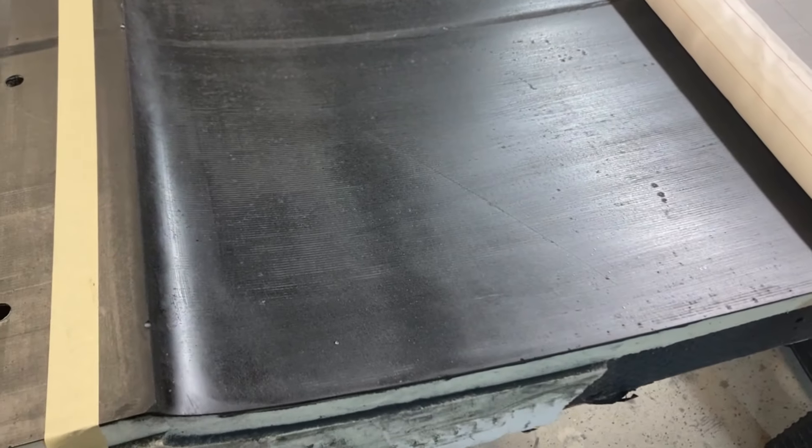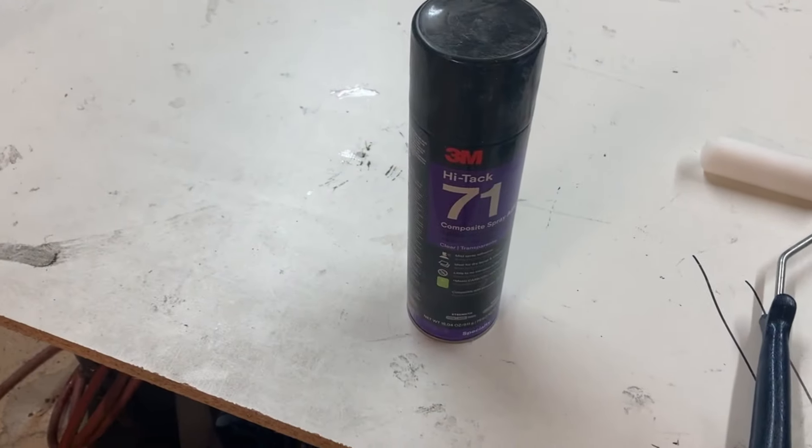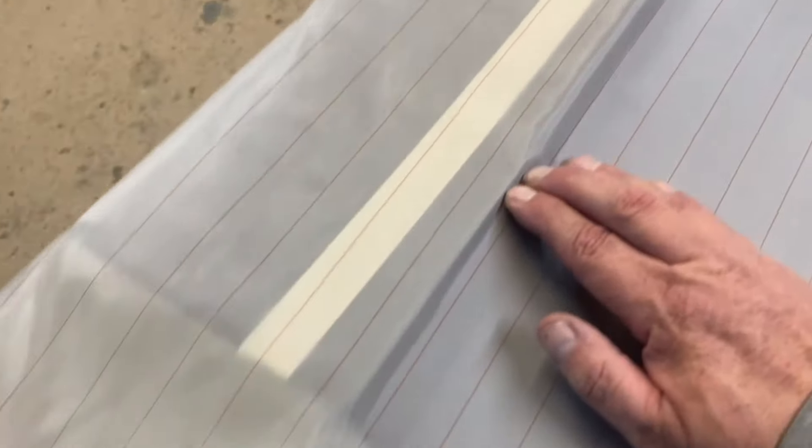So this is the finish with four coats of wax on the mold and some PVA. You can see there are still some little imperfections, but again I'm not worried about that. I've also sprayed the surface with 3M 71 high-tack adhesive — what that does is it dissolves in the resin. Unlike 77, which is really not for epoxy composite layups, I used the 71. Now I'm just rolling out some peel ply and since I have that 71 on here, all the wrinkles get smoothed out real nice. I'll push it in here like that, get all those wrinkles out, get it pushed up in the leading edge. That will be the outer surface of the part — it'll give me a peel ply finish, which is fine. I'm not going for gloss.